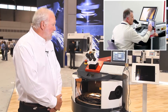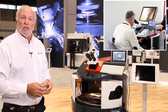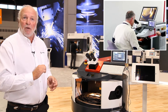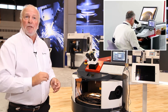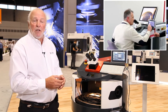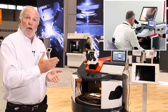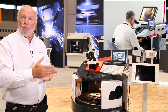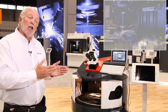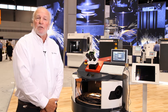The training feature is useful when you have complicated-looking parts and don't have enough of them to justify a full CNC program. All you do is follow the outline of your part, put in a couple of points that tell the laser where to move, and then with our sync weld, welding points come out at a very precise distance from point to point. The more overlap you have, the stronger the weld — achieving vacuum-tight or water-tight welding depending on how close the pulses need to be.